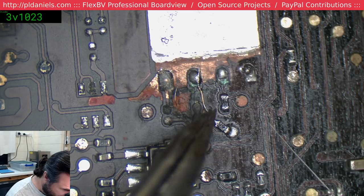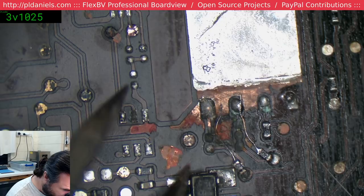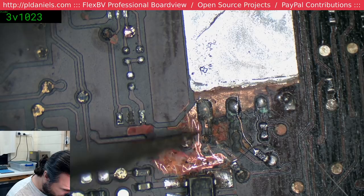Yes, chip selector. So, and then this wire is perhaps a little too thin. It'll break pretty quick and easy. It just needs a bit of a rework. Plus, all this has to come off. See how that's just flaking off? That's because the corrosion's gotten under there. You gotta clear that all away. Otherwise, it will come right on back. It's like cancer, this stuff.